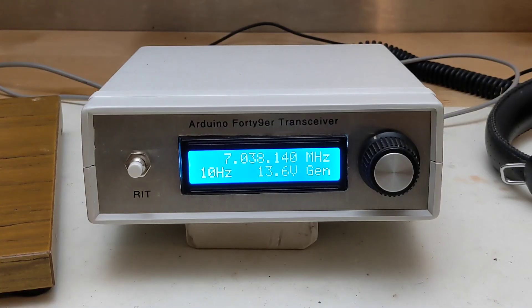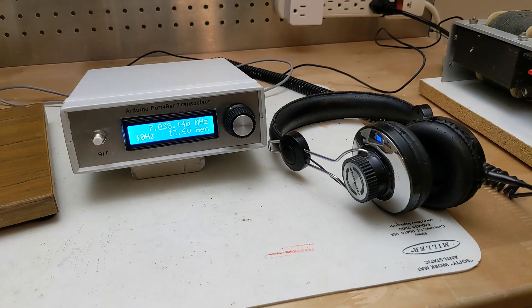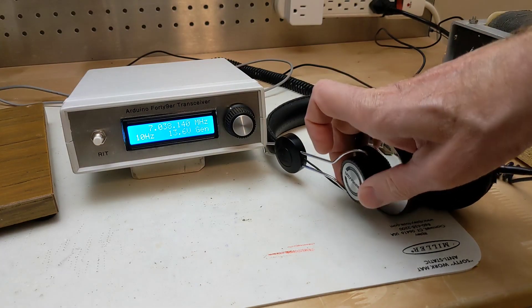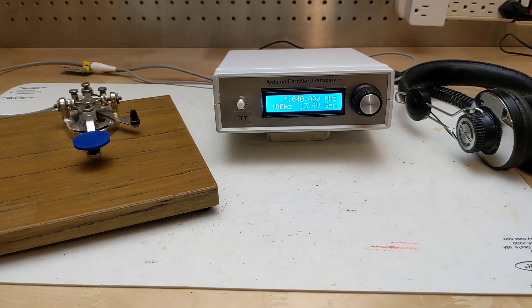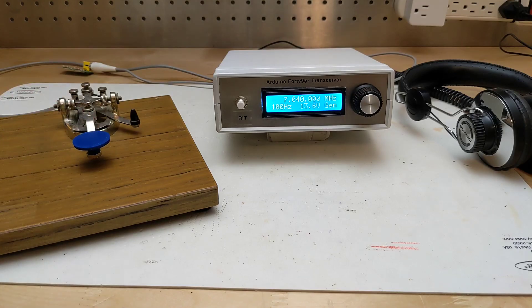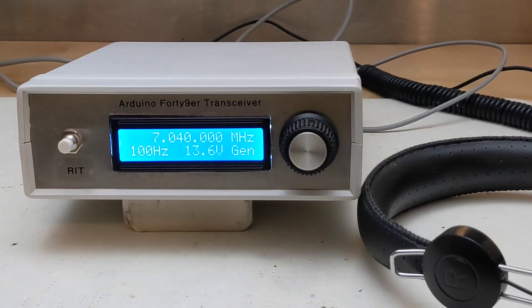My version of the software can be found at the GitHub link listed in the video description. Audio output is to headphones. There's no volume control, so I use phones with an internal volume control. To transmit, you attach a code key or keyer. The unit will run from 9 volts to 38 volts DC. At 13.8 volts, my unit puts out almost exactly 2 watts of RF power. As a quick check of my radio and antenna, I can send a short test transmission and see that it gets picked up by the reverse beacon network.